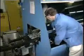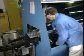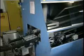First, set the conveyor width based on the board size or pallet size. The fit of the board should be loose enough to allow the board or pallet to slide in the conveyor. Tight fits can result in bowing or distortion at higher temperatures. This can cause unsoldered areas where the bottom surface of the board does not touch the wave. Next, turn on the conveyor. Set the speed as required for this particular assembly.